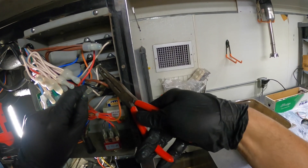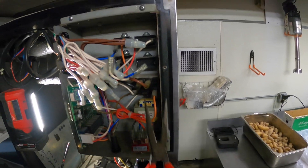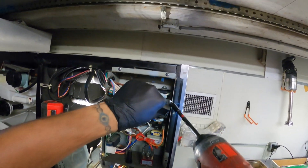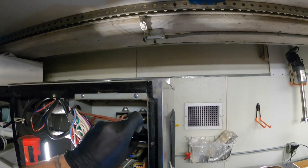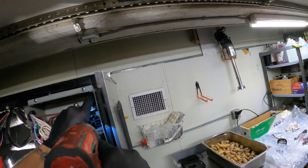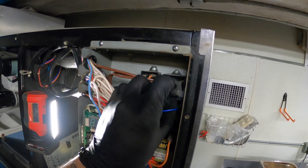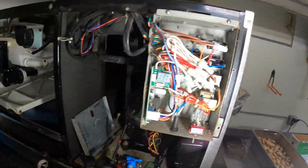I'm just going to pull out contacts on the electrical just to be safe — short it out, but I think it's fine. Got a screwdriver in there — in this case our drill. There's one screw there and we can pull it out. It's also a 5.5 microfarad. I'm going to push the new one in, put our screw in, get it in the hole — and put the same wires back the same way. Make sure it's all tight and we're good to go. Pump is in and our capacitor is done.